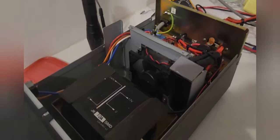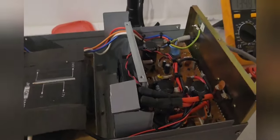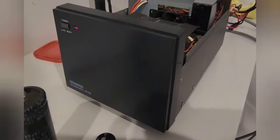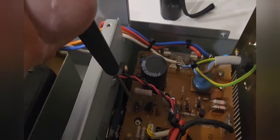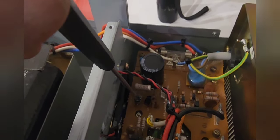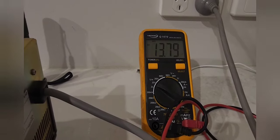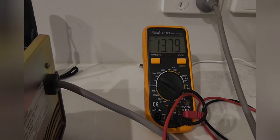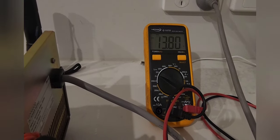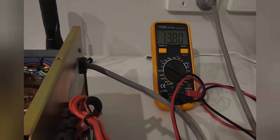There's not much to this even though it's taken about four and a half hours. I take pride in my equipment. I'll just turn it on — these don't have a voltage meter on the front panel, so via VR1 here, which is for the voltage, I've got it set up rock solid on 13.8 volts. Anything up to 25 amps, there's no voltage drop at all on these — they're an absolute solid performer.